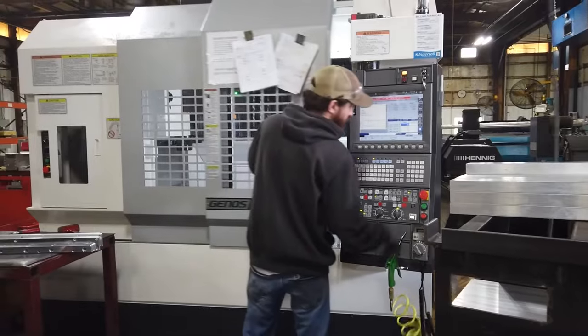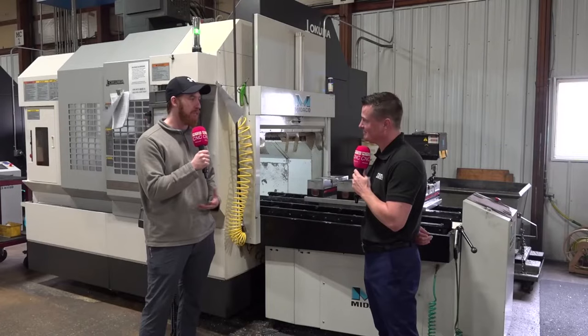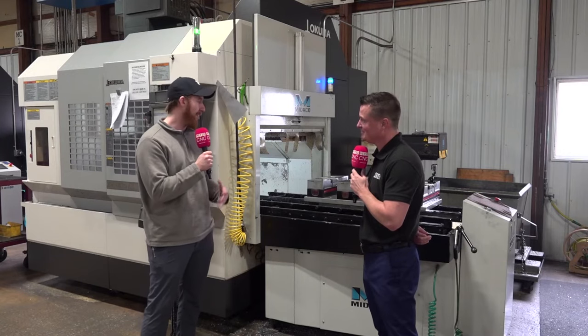It's been just a whirlwind of changes on our part. When we first started, we had four chick vices in here and we were manually loading, unloading, blowing out the vices. You had downtime of say one to maybe three minutes of load times, with a man standing there loading the machine while the machine's waiting to run.